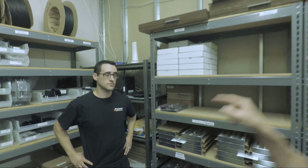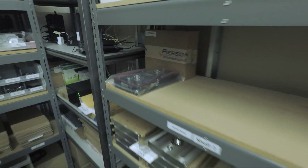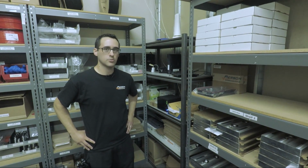There's potential down the road for being more nimble, for being better set up for multiple different jobs. And you can even put a vise on top of that, which at first seemed crazy, and you've got a lot of money in the vertical stack of work holding, but it's fine if it's the right decision. So selfishly, I'm here because I want to learn a little bit more about spanning 3 of these across a VF2 and having that be that machine's normal operating position.